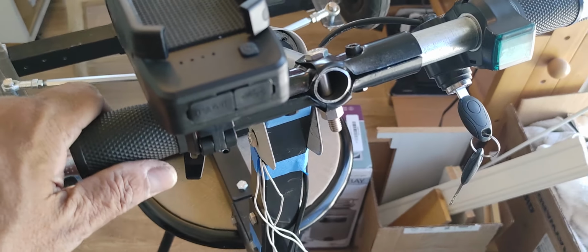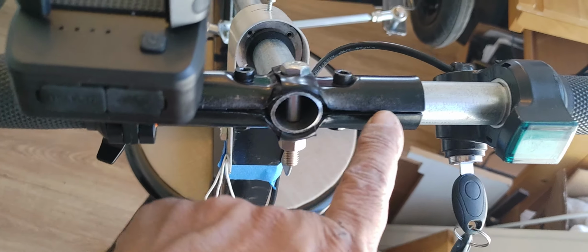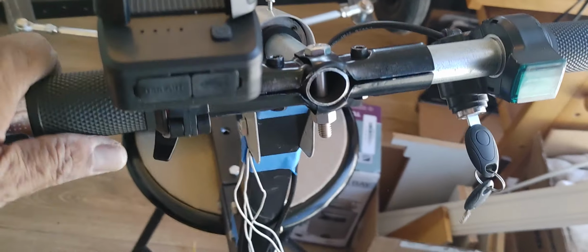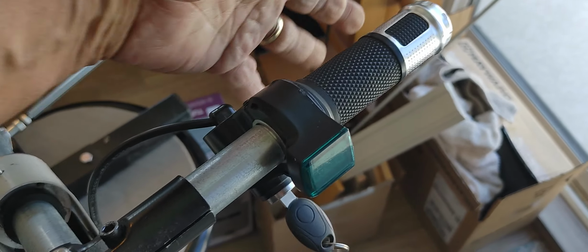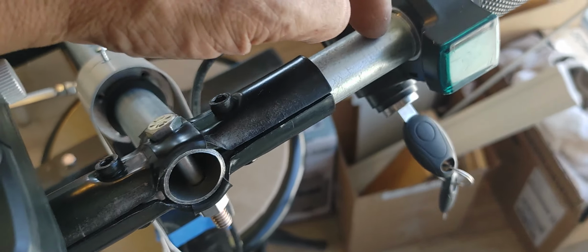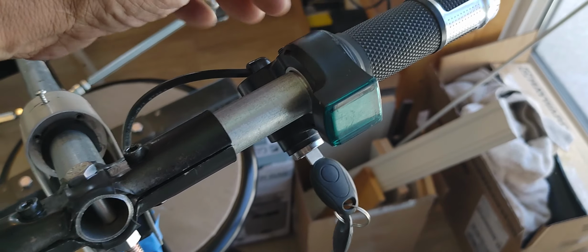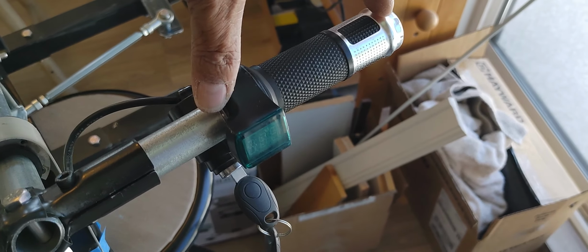The other thing that I'm going to change, a modification I guess you can call it, is this bracket right here. The way I did this is also another maker pipe connector that has two side clamps, so you can connect individual handles here. I'm not liking this because it's wobbling a little bit, but it also has to do with the fact that this handle system requires a certain diameter, and this pipe, the 3/4 EMT tubing, is just too big, so I had to put this on my lathe and shave some of the surface so that it fits here. Although I did it pretty precisely for about an inch, it really requires this to be done almost the full length of the pipe, to this point right here, so it engages completely on the handle, all the way through the inside cavity of this handle.